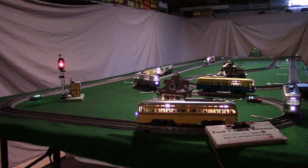This last car — we don't slow it down to speed four. We just stop it as soon as we can. We send a speed zero command to it as soon as the detector detects it. You can see everything stopped and the status light went back to green. Those cars will just sit there and wait for a minute or half an hour or whatever, until somebody comes along and pushes the start button. Then they'll start running again.